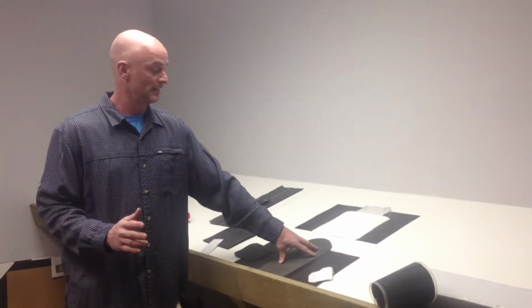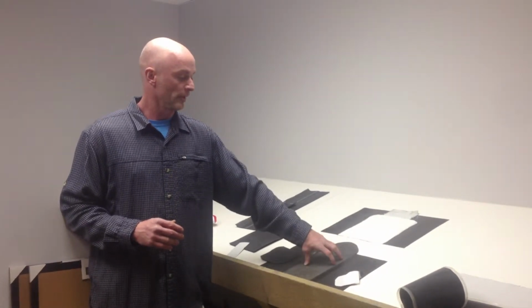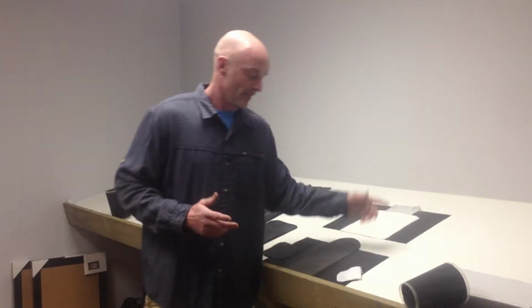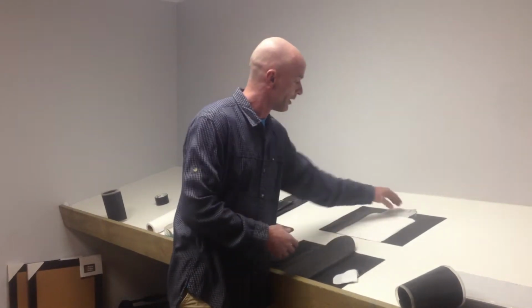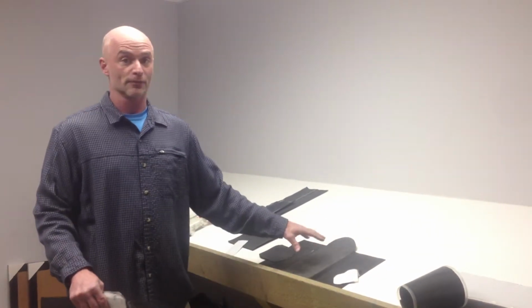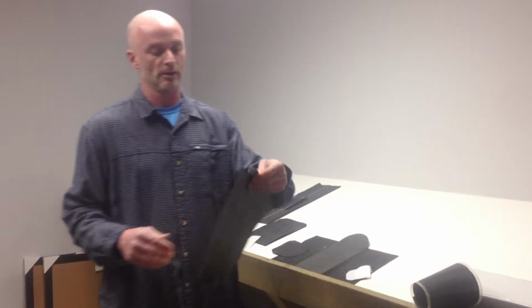I don't have any scientific evidence, but I can tell you from my experience, when we take old EPDM, clean it, prime it, and put a new roof cover tape on it, anywhere from 2 weeks to in some cases maybe 2 years, we do get failure where this peels off. You could have hundreds, if not thousands, of feet of this basically fluttering. Put your hand under it, and the other problem is you're now bucking water if it's downhill.